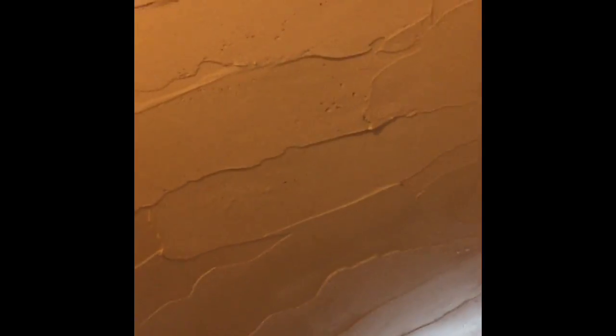It's all laid in. Just a bit of advice — as you can see, you can see ripples in it, like waves. You'd rather have things protruding right now than dents in it, like gouges out of it, because they'll be harder to fix. This stuff on the top I'll just move around once I start troweling it up. I'll get it moving. I'll just cross that wall as well.